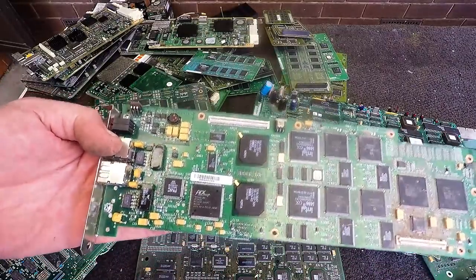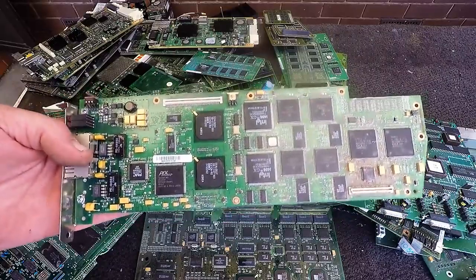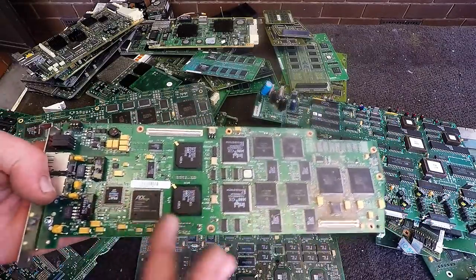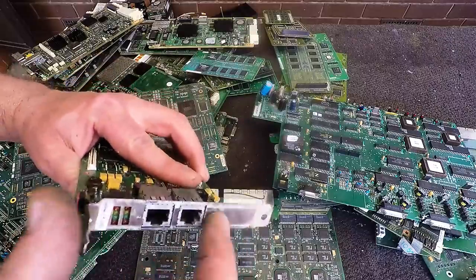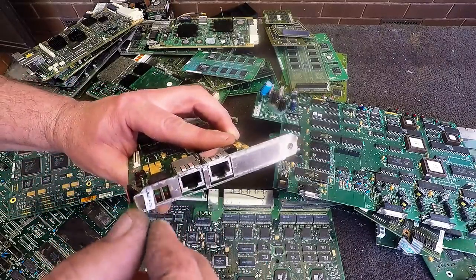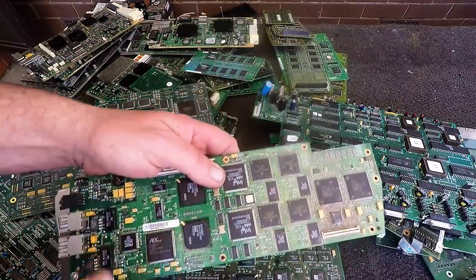Almost, well, it is a slot card, but in this case it did have fingers that they've cut off. Even though this would have always been worth more than just slot card value, so this should always be telecom. Even though they've cut off the fingers, it's still a telecom grade. Little rubbish. The only thing you would have to do, because it's no longer a slot card, you should take off this bracket, undo the screws and actually take off that steel, because these brackets are only accepted on slot cards. But because you've cut the fingers off, even though this is still worth more than a slot card, now we need to remove that steel to make this a telecom grade board.